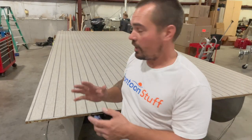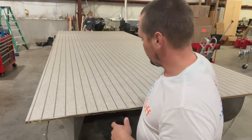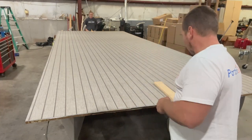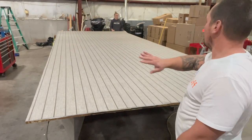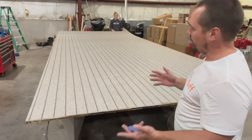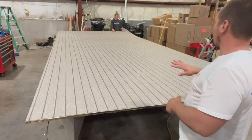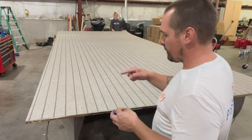As you saw, we laid the glue and rolled it out with a PVC pipe, putting body weight down on it to roll out any wrinkles and smooth everything out. Lines still look great and straight. We're now going to remove our clamps from the center, roll the other side back, and apply the glue just like we did. It's going to take almost a whole gallon on each side — apply it thick, keep working it till it's uniform, then smush it down with the vinyl to get that felt backing to stick to the deck. We'll roll it out and then use a razor blade or sharp box cutter to trim the edges.